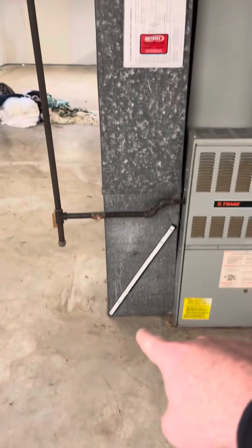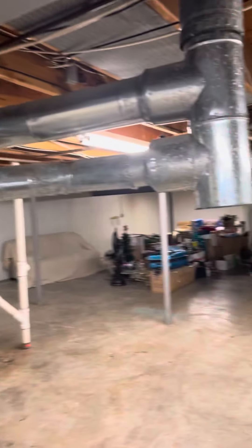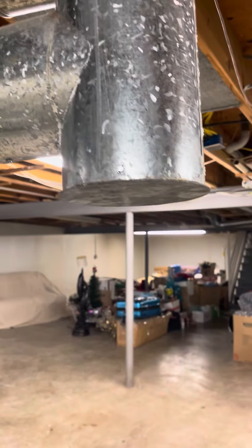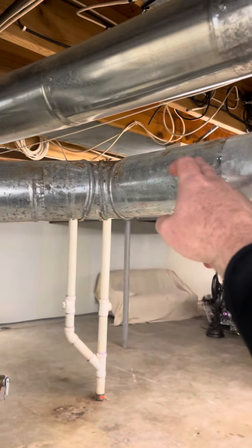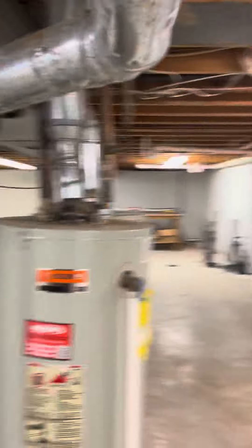This is 78 inches tall right here, and we've got enough room to play with up there to get the 12-10 Aprilaire box. This cleanout is a 6 inch. 6 inch, 4 inch flue — which right now this is a 5 inch flue for the water heaters.